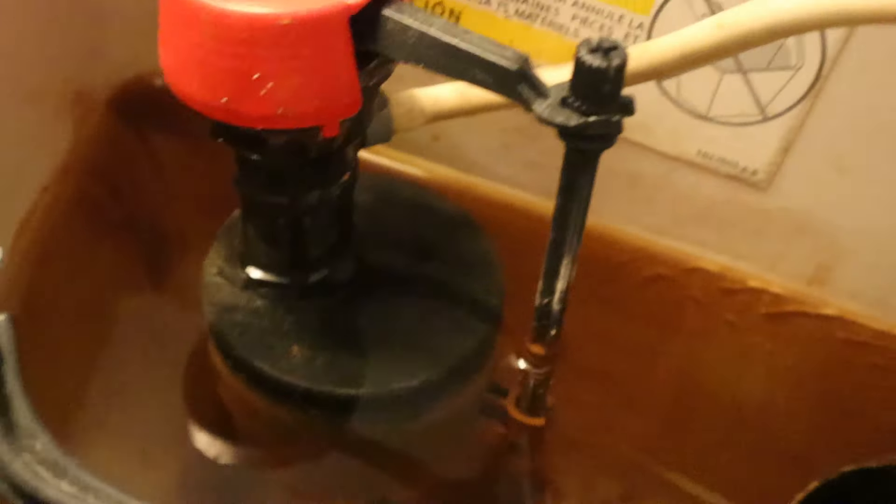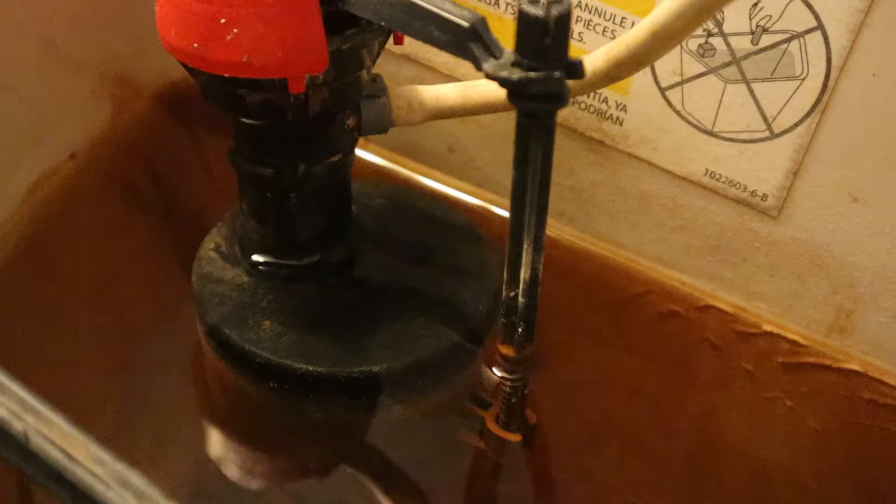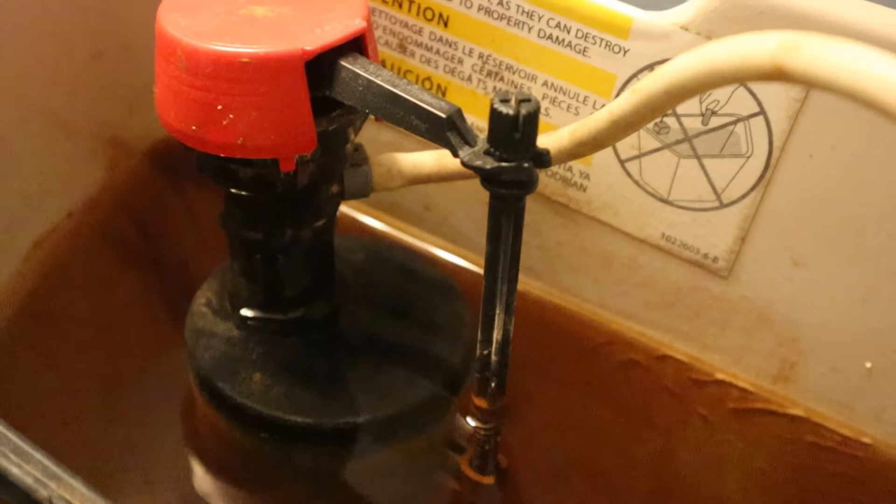So as you can see we're in the bathroom. The toilet has a problem with the fill valve. The valve itself doesn't seem to shut off properly — it goes down to a very small trickle but continues to fill. As you can see it has filled up above the float, so the valve is not shutting off. The valve also tends to whistle or screech when it's filling up.